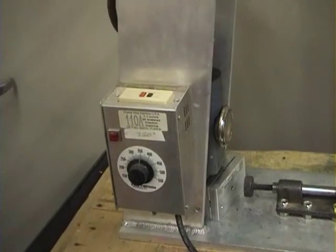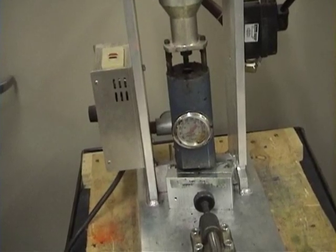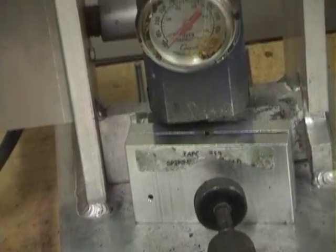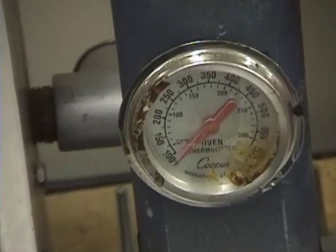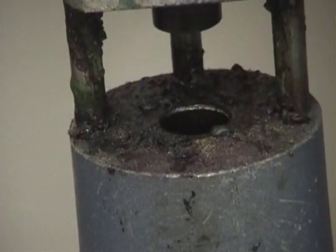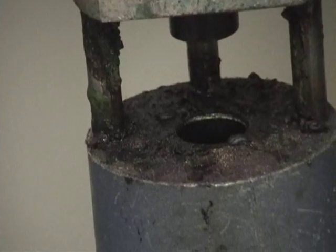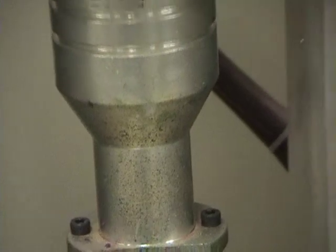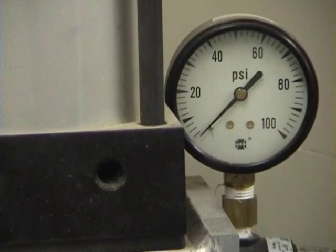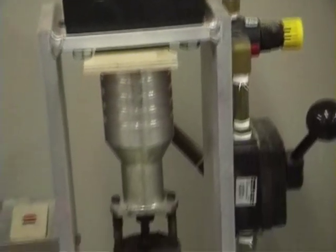It holds 1.1 ounces of plastic, so it's very small, yet they're pretty expensive machines — I'll show you the exact price later. Right here we have a clamp that holds in the mold, and here's the oven. You want it to go up to about 300 to 350 degrees. That hole is where you put the plastic — if this were a real manufacturing place it would have a hopper, but we have to do everything manually. Here's the pressure gauge, and you want the pressure to be around 38 PSI when we actually plug it in.